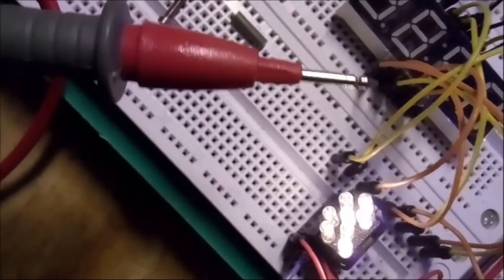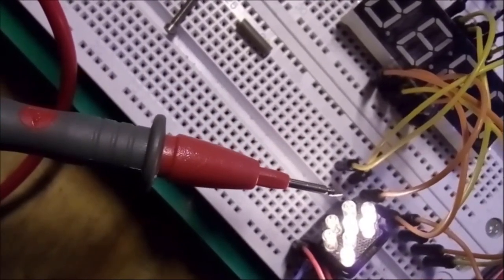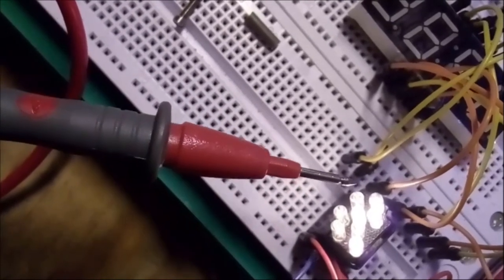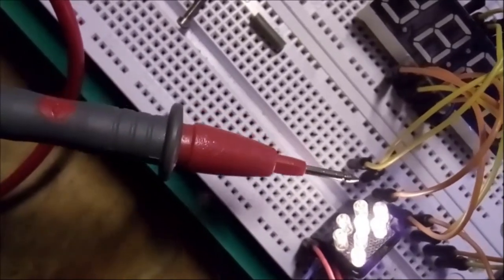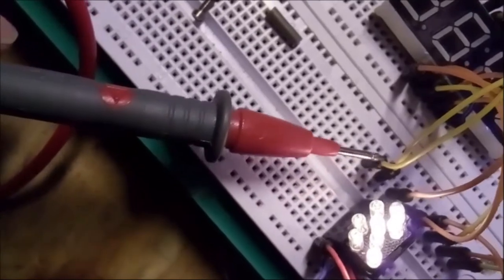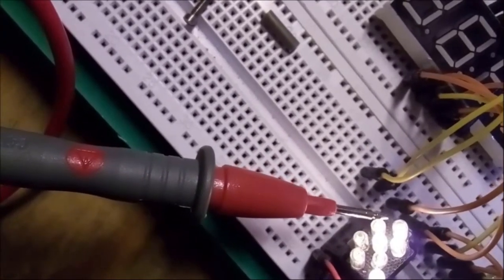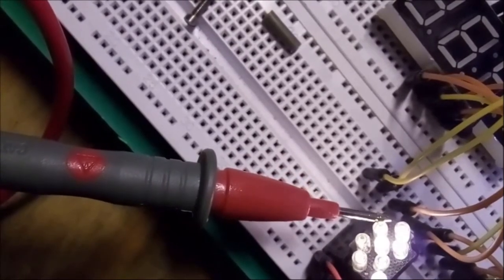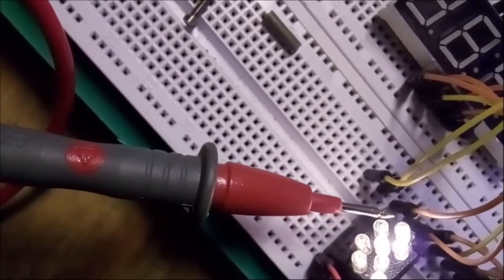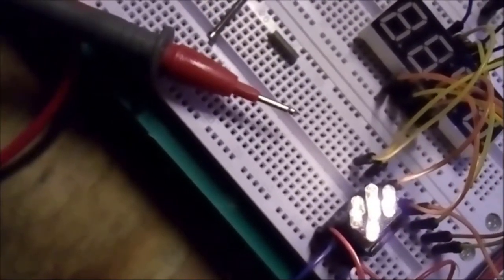And I, you know, I'd really rather not do this, because this is very, very fragile. Yeah, and if you bend and unbend it several times, you really risk breaking it. So, well, I'll have to be extra careful and unmount the little top PCB somehow, and then see where the bad contact is with this little light bulb here. Okay, because if I give it a gentle push, it lights up. So the leads on the other side, or one of the leads at least, must be making bad contact. Very, very unfortunate. Well, okay, there's nothing to it, so let's just do it.